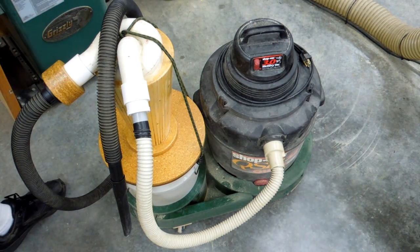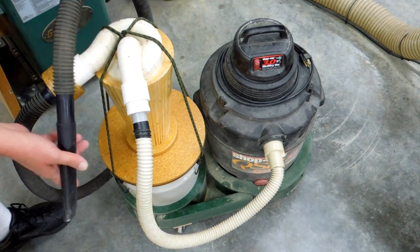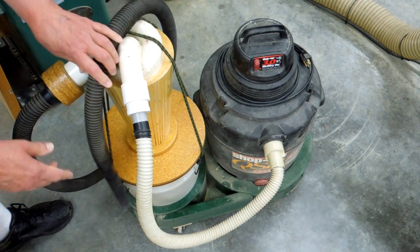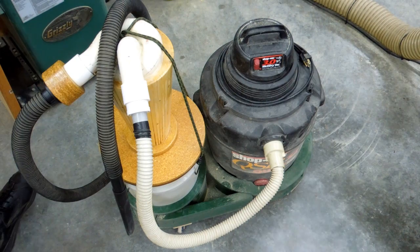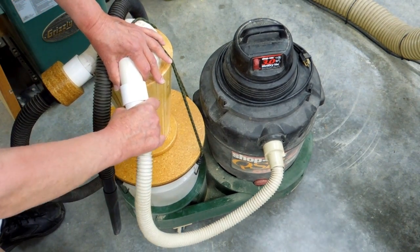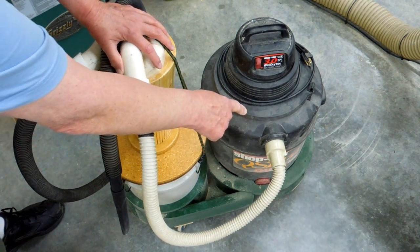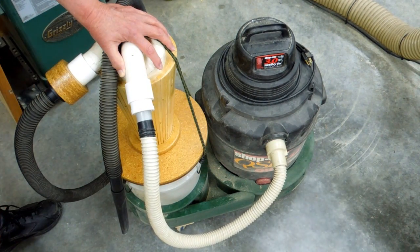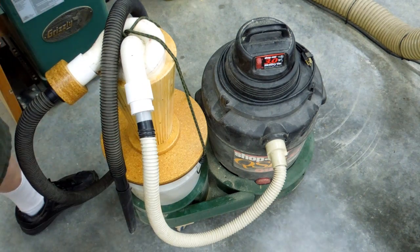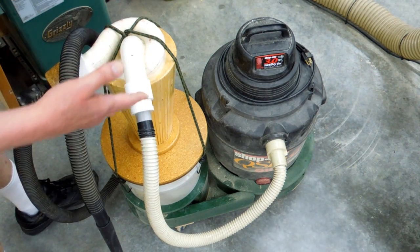People have mentioned that my cyclone is not big enough for the hose on their shop vac. This shop vac came with a hose whose smallest part is about an inch and an eighth inside diameter, which is adequate for cleaning up around the shop and connecting to sanders. This is an inch and a half inside diameter piece of pipe. You can adapt this all the way up to a two inch hose. Twice the diameter is four times the cross sectional area, so you can get a lot more flow through a bigger hose. Or you can make this whole thing out of a slightly larger piece of pipe — just proportion the whole thing and it will work just fine.